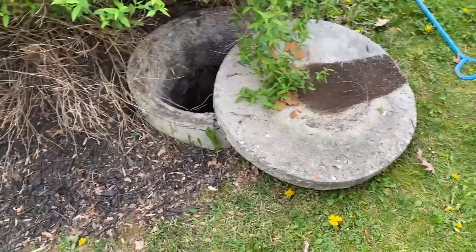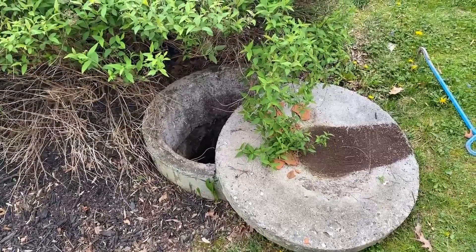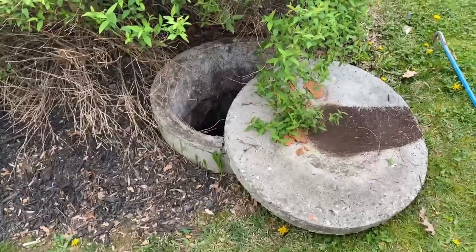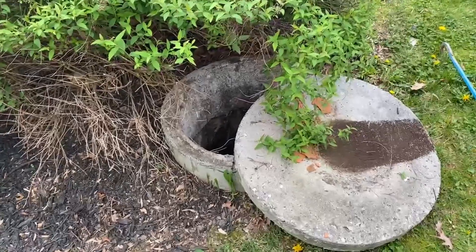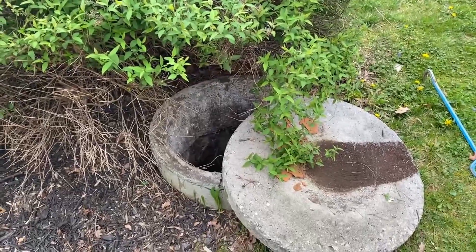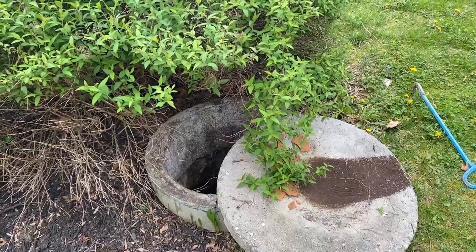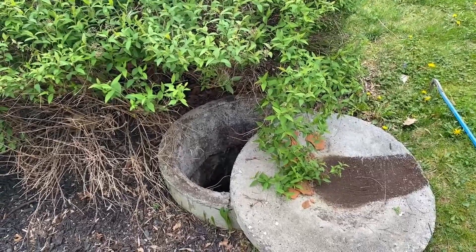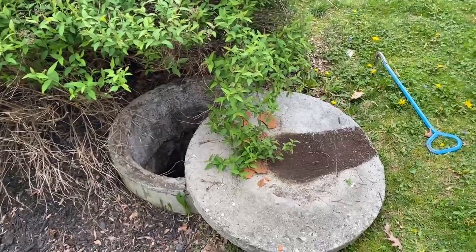Pump chambers are basically a septic tank with a pump that pushes the wastewater through the outlet line rather than being gravity fed. These pumps generally last about 10 to 15 years, and with no debris you can sometimes see up to 20 to 30 years out of them. The high water alarm exists to let you know the pump has failed. If you don't have one, contact your local installer to have a float and an alarm box installed in the house, because one day it will fail and you do not want sewage in your yard or your basement.